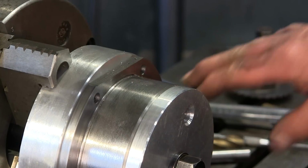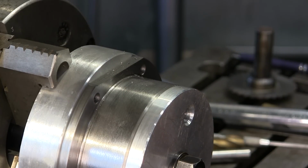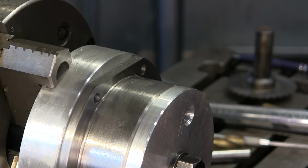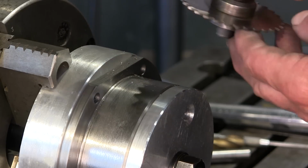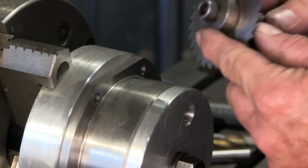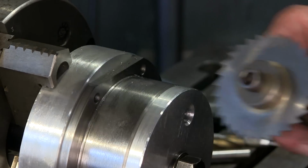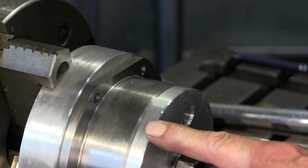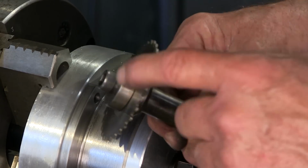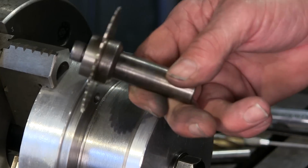All right, let's go ahead and clear off the table and lift the dividing head. We're going to release it from the table, lay it on its back, and realign it square after we check our travel, what we need for clearance here. This surface right here is real important that it not jam into the collet. And then this right here is going to be real, real close.